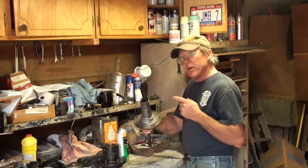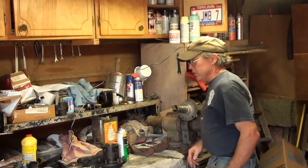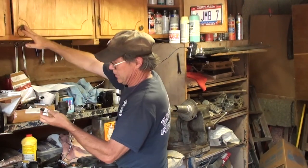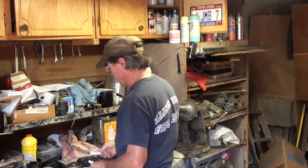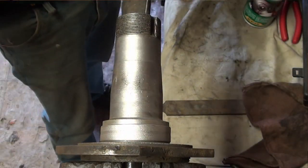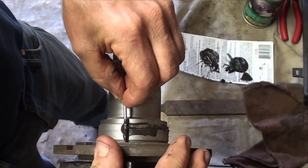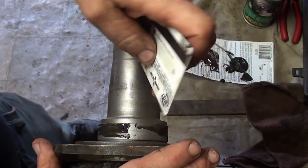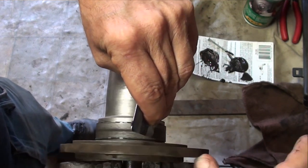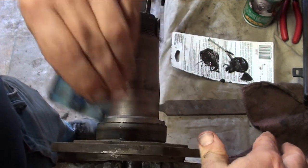Pretty. Okay, so now I've established a nice profile on here — in other words, I made it all pitted and rough. So then, with a nice rough surface, a little bit of JB Quick Weld is in order. Now because it's about 85–90 degrees, this stuff is going to set up in a hurry. I want to pay close attention to my seal area. I'm using a non-functional credit card to put a nice smear on it onto that rough surface to give it a good bite.